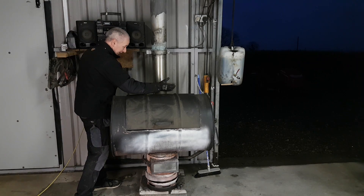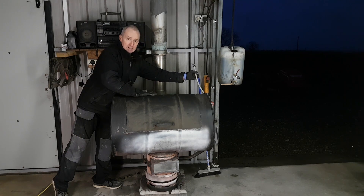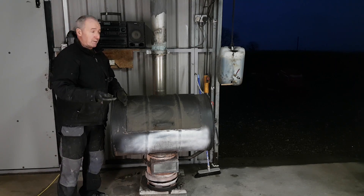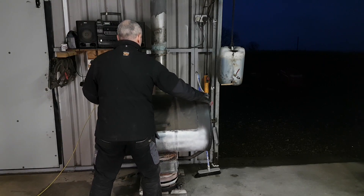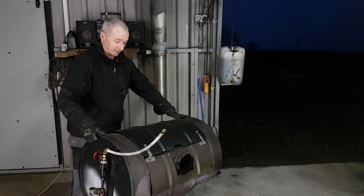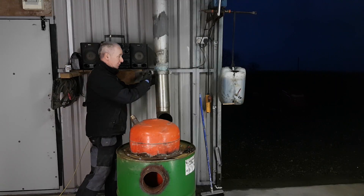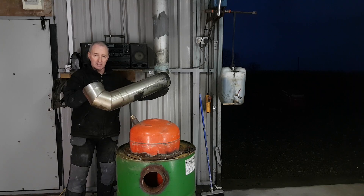Let's take this out — it should be as easy as whacking this. We're disconnected. The oil on this side is already disconnected. That's my oil tank — two connections on it. The lower one is just to drain off water and any contaminants in the oil, but I filter the oil before it goes in there first, so it's just an added safety measure. This thing isn't overly heavy, I should be able to lift it. Now let's take out the old flue — it's only pushed up there with some packing. There goes the packing. That's 6-inch stainless steel flue.